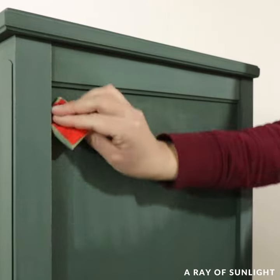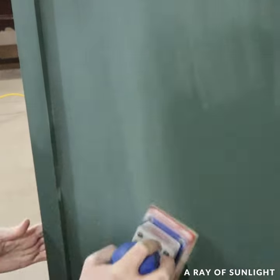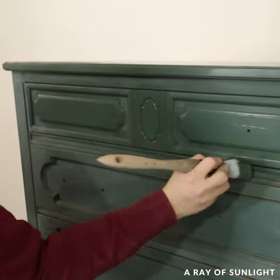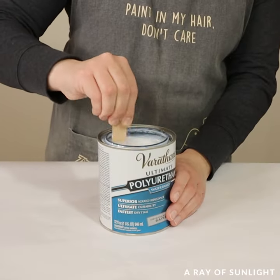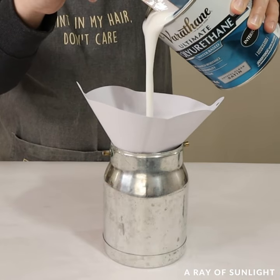When I came back, I did what I should have done in the first place. I removed the keyhole, sanded all of the brush marks out of all of the paint, and then lightly brushed on more paint. Then I sprayed three coats of my favorite top coat on it, which was still Varathane, but with my paint sprayer.